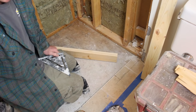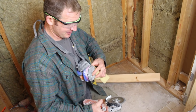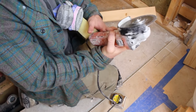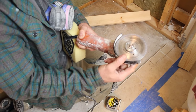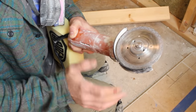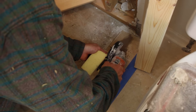We'll cut this tile, and what I have to cut it with is a wet sponge so that the dust isn't terrible. I do have a respirator that I'm going to be wearing — it's called a Sundstrom respirator. It's kind of small, nice, and easy to have hanging on you. I'm going to be using this angle grinder. I really like these blades — these are Montolit's CGX 115, a 4.5-inch grinder wheel. I like how it cuts because it has diamonds kind of on the edges of the rim, so it gives a really nice cut, especially on porcelain tile. As you can see, this angle grinder and the CGX 115 diamond blade do a great job cutting through the existing tile.